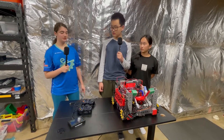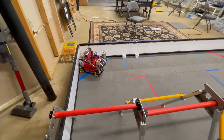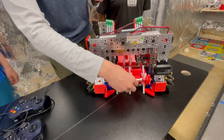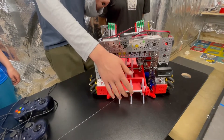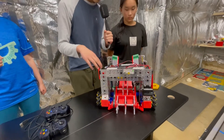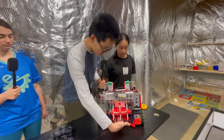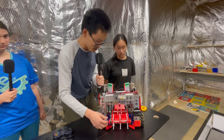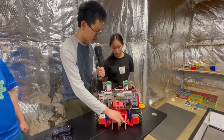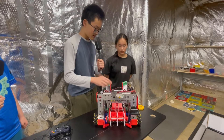So can you please start off by talking about your intake? For our intake, we use surgical tubing and we printed our custom tube holders to intake the pixel. Our ramp directly transfers into the outtake for quick and easy transfer with minimal issues. We also added something so the pixels can only go straight through and can't go back up. We have a 1,150 RPM motor so the intake can go really quickly.